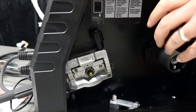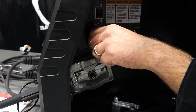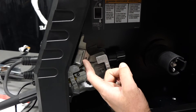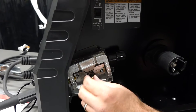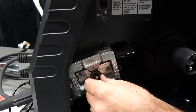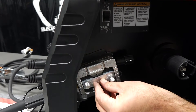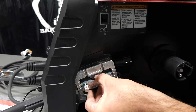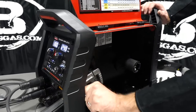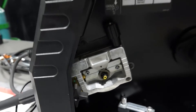If you remember my video on the 215, this style is on the 215, but I also mentioned it on the industrial equipment. The industrial feeders — this has been the standard for quite some time because it's foolproof: it works and it doesn't mess up. To change the drive roll, just toggle that and it'll slide right off. Pretty simple. There's an arrow direction to show you the correct orientation. And then that's your MIG gun tightener to lock the MIG gun into the power block — very simple, everything slid right in.